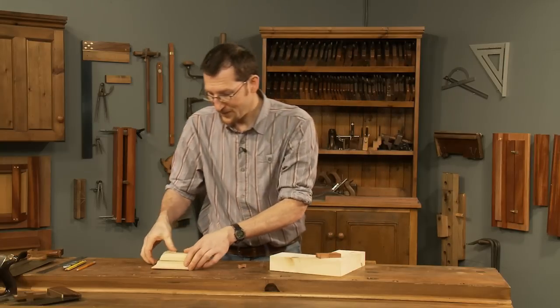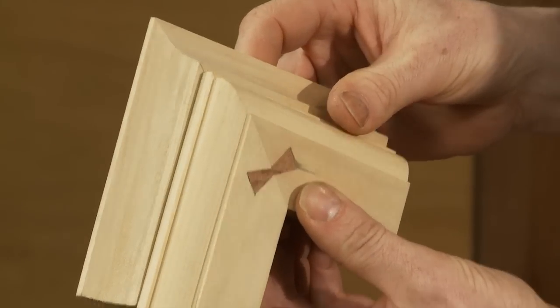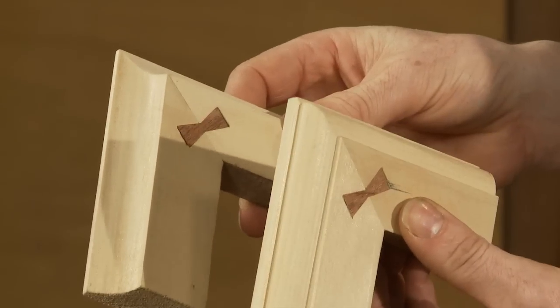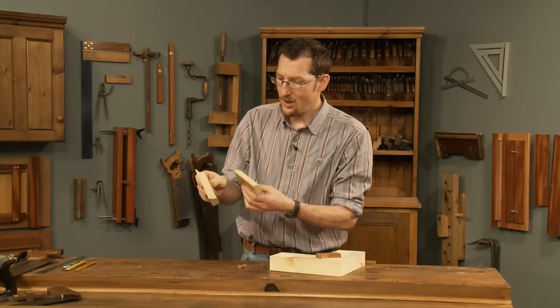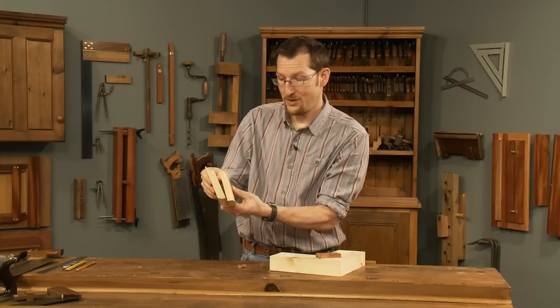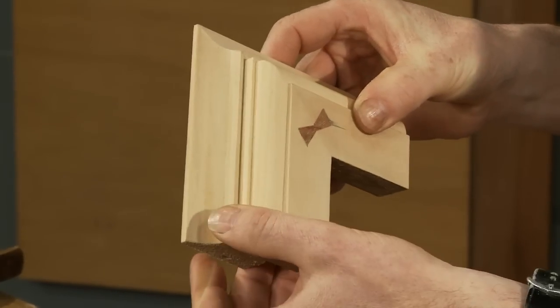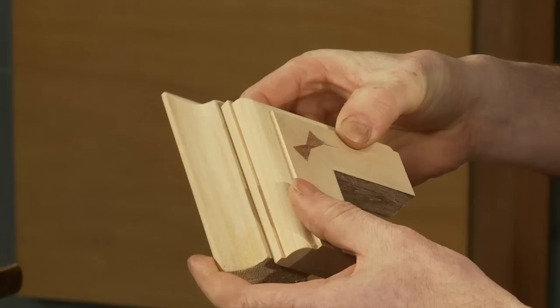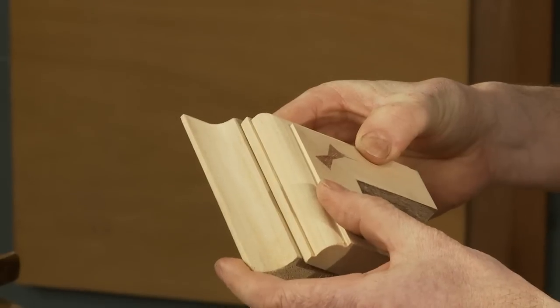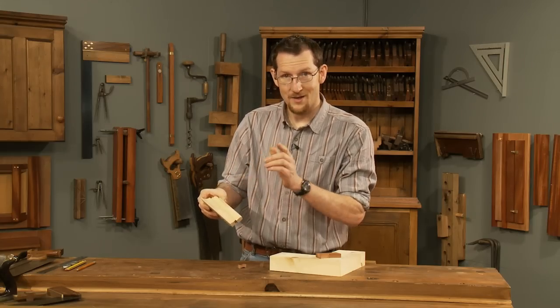What we're doing here is producing a glued-up piece of cornice, and that's going to be made out of two parts. I'd recommend that you do this butterfly key operation on both parts before you join them together, because that way, when it is finally glued in place, you end up with a very strong joint with altogether four butterfly keys holding it together. But the first thing we need to do is to cut our mitres, and we'll do that now.